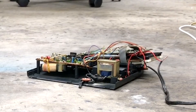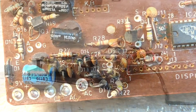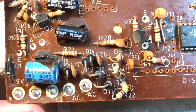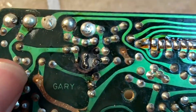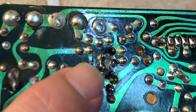Here we go one last time on the GPX. Here's power, three, two, one. Something popped - I heard a pop. There's smoke coming out of it. That's good. Here on the display board of the GPX you can actually see what failed - these diodes here. They just got overpowered by the 230 volts. You can see on the back the circuit trace right there - that's actually what failed.